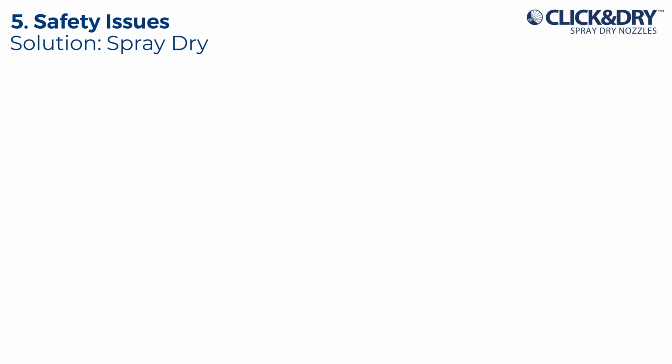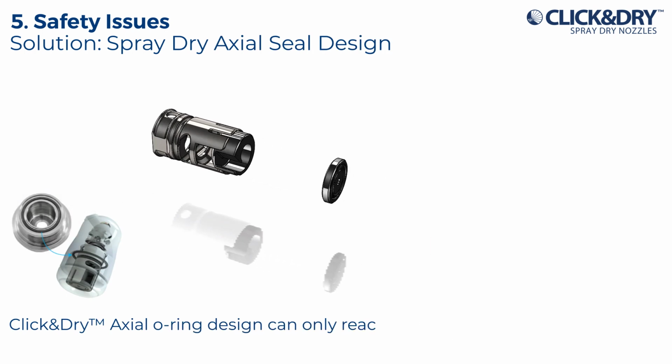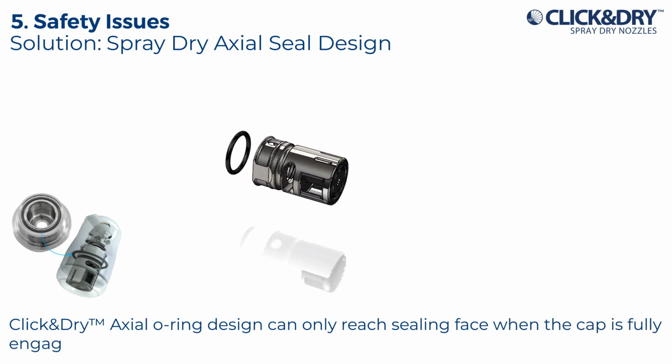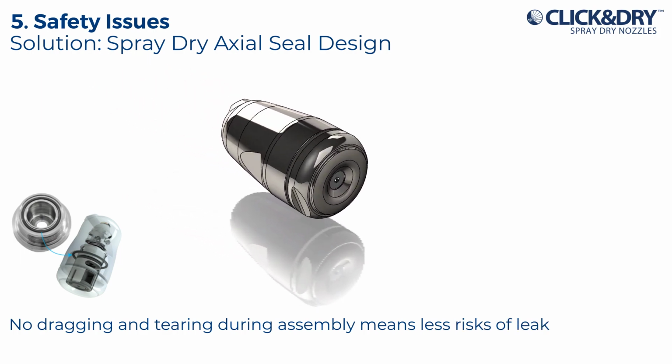Solution: spray-dry axial seal design. Click-and-dry axial O-ring design can only reach the sealing face when the cap is fully engaged to the body. No dragging and tearing during assembly means less risk of leakage.